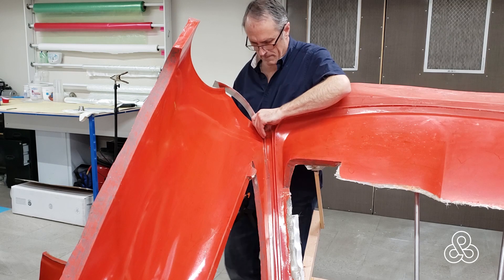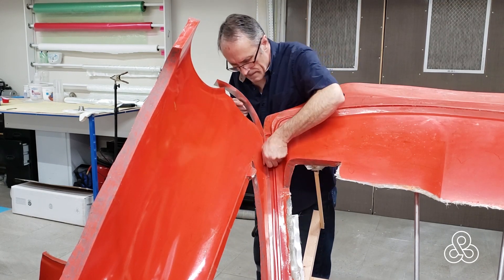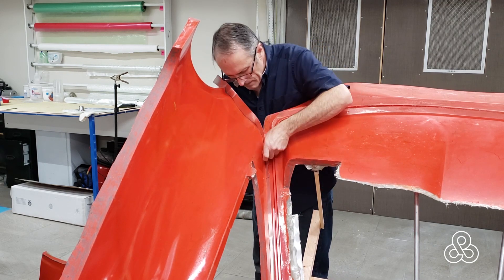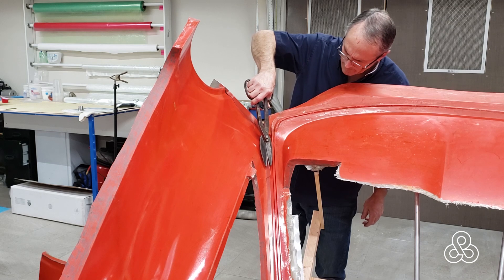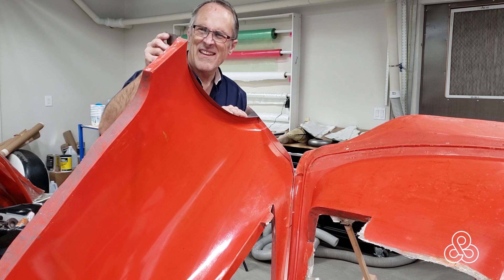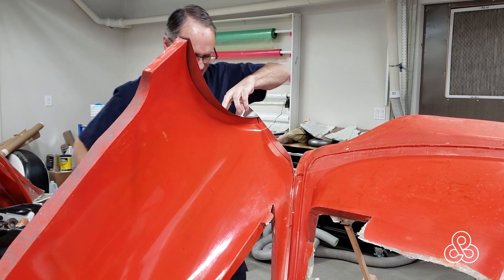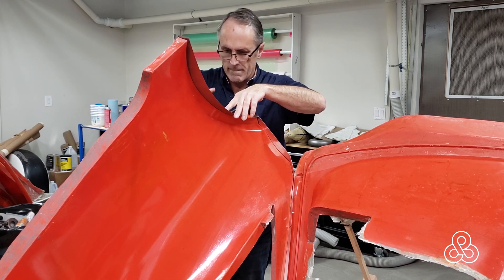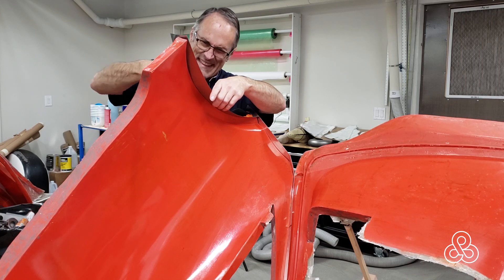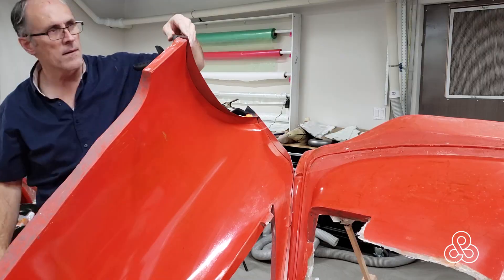And once it comes out between that pinch between the molds, you're going to have to lay it against the flange which will just be clamped. Some clamps back there — you can't see them too well. Once it's clamped in place, there's a piece sticking up — trim it off. For surfaces that need a very smooth turn, if you use that light gauge metal, the clamps will tend to distort it around these open flanges. So I'm using a little heavier galvanized sheet metal, about 20-22 gauge.